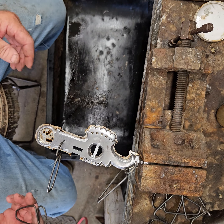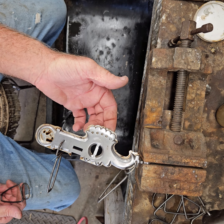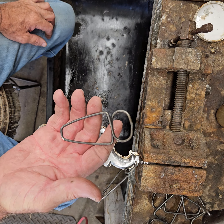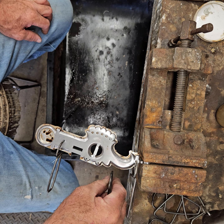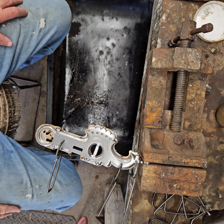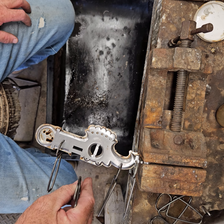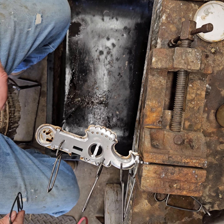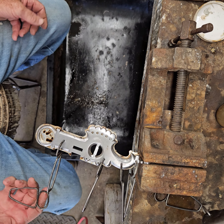As you can see, I've got my cheek so that the face of the cheek is down and my silver with the solder on it is facing up. I'm using these Collins company tool clips — absolutely love these things. They're so much better than using a cotter key and all that kind of stuff. Cotter keys are designed to bend easily; they're not designed to hold their spring tension, so as soon as you put heat on, any tension you had with your cotter key is pretty much gone. I'll put these clips around here, as many as I think I need, to get everything to hold in place.